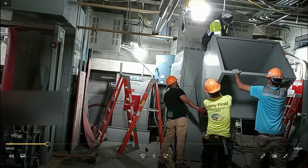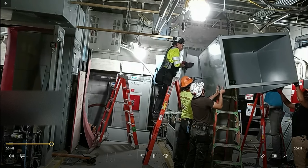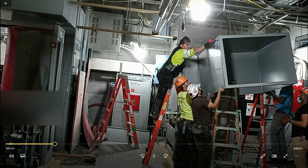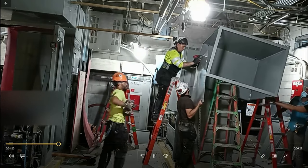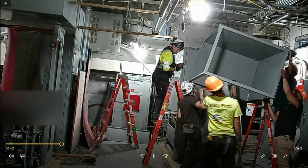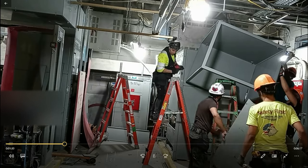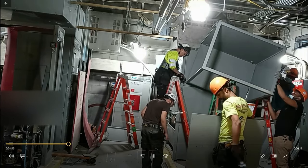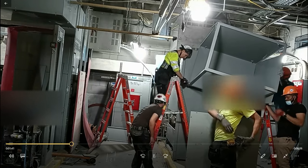What you're looking at here is a service that we had taken apart and relocated. The only thing staying here is the actual main switch. Everything else is going to go to another location — your panels and distribution panels will be at another location. We're putting a crown box here so we can bring all of our conduits into it and land our wires into that main disconnect.